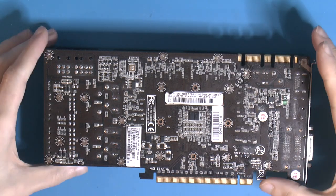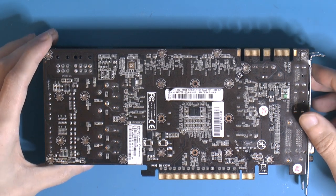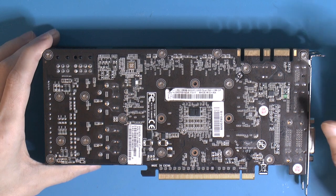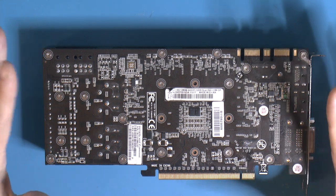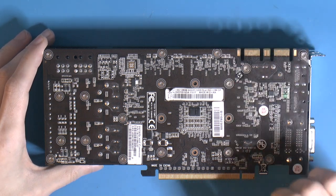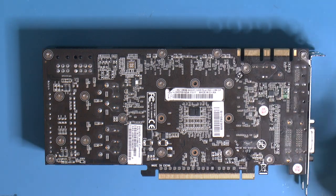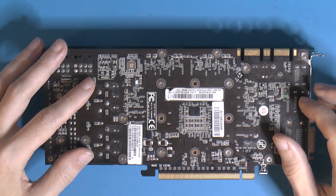memory. So this card was sold as defective, and therefore probably no one else bid on it, though people tend to bid on a graphics card anyway, in hope of fixing them, I guess. But this one is probably a little bit too old. I could see there were a couple of missing ceramic SMD capacitors, so I figured it could be worth trying to fix that.